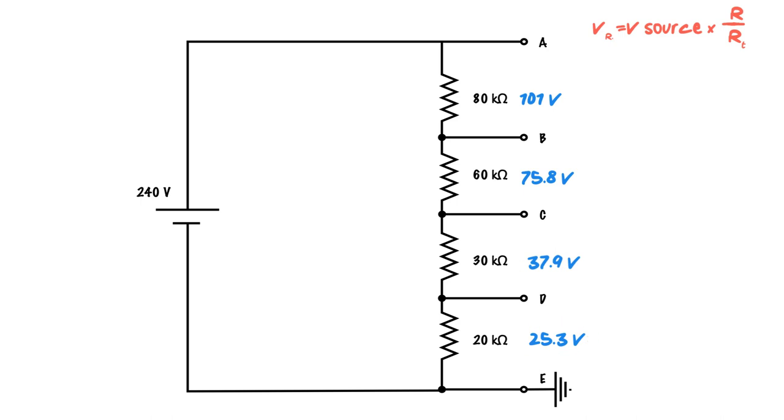So now we have our voltage drops across each resistor, and if this was a series circuit and running fully on the way it's supposed to go, that's what we would see across each one. If we put a voltmeter across each one, that's what we would get as well. Now if we're taking these and we're measuring the voltage in reference to ground, if I look at A, if I took a meter, let me just draw in a very crude version of a meter.